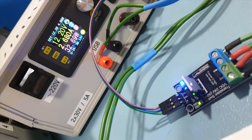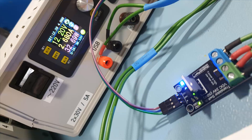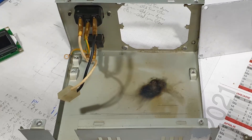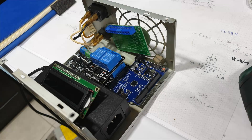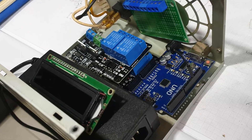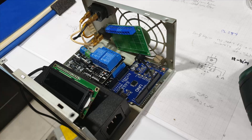I found this power MOSFET module which they claim can withstand 50 watts and it takes easily 2.6 amps with no heatsink. I'll show you later that my motor takes about 3 amperes at full load. The case for the controller is from an old computer power supply that had exploded, and I tried to squeeze all the components inside including an old laptop power supply — 12 volts, 5 amperes — to power the stuff and run the motors.